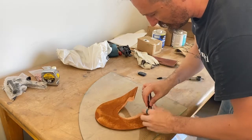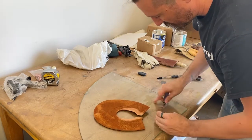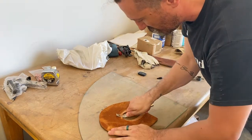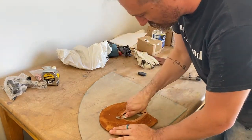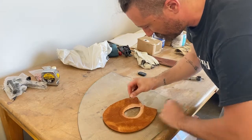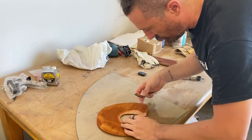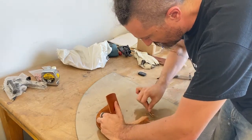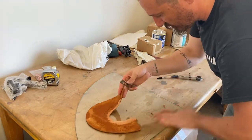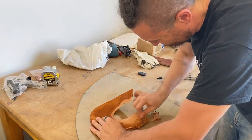And flicking it, usually I'm able to wipe the blade off when you're skiving like this, and you can get a nice tail going and flick it off. I know some of you guys probably already know this part, but for some of you who don't or need to work a little bit more at skiving and getting used to where you're going to be putting your skives, that's just to help those guys out. Anyway, continue to clean your area.